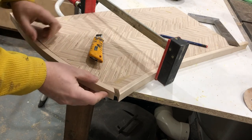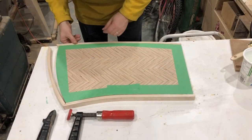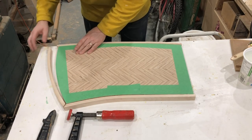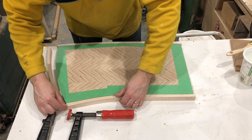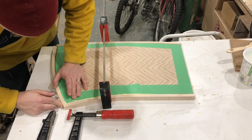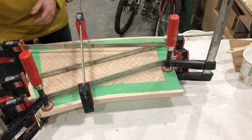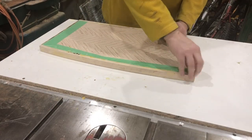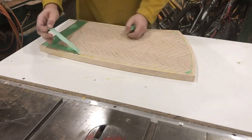The miter fit is pretty good. All that's left is to glue and clamp these pieces on. The green tape you see is only on the top and bottom surface, just to help keep cleanup to a minimum — I can just peel the tape off when the glue is dry. It doesn't actually take a lot of clamping; the spring-back was fairly minimal on most of these pieces so it glued up fairly well. Removing the tape takes a lot of the sanding away.